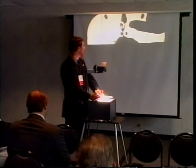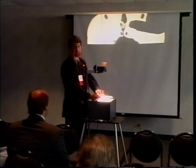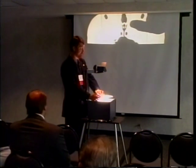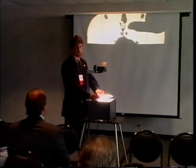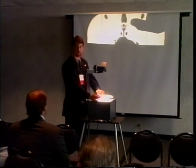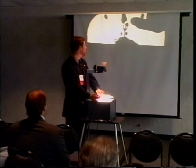Now, naturally in a watch, you can't measure that, or can you really see it, but you can feel it. And usually, you want to move your balance wheel about 45 degrees from the rest position to feel that. Move it back 45 degrees and then 45 degrees the other way and feel it on that side. And you want to feel that to make sure that it's equal on both sides of the line of centers.